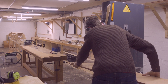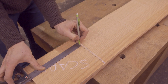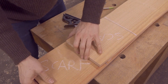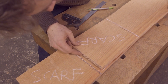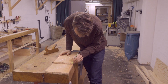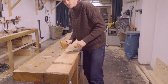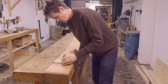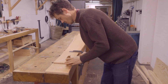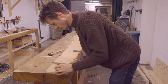It's very easy to mix up once the planks are flipped around. Now I've cut off the waste outside the chalk lines and also cut off the ends with the splits. My next job is to align the two planks so that the 24-centimeter line on the lower plank matches the edge of the upper plank. I'm also aligning the center mark — this mark will disappear once I'm done planing, so to make alignment during glue-up easier I'm making new alignment marks along the edges of the upper plank. Now the planing can begin. I've aligned the leading edge of the lower plank with the edge of my workbench — this will allow me to plane the plank all the way down to a feather edge while the wood remains supported. I've secured the planks to the bench with a couple of clamps.